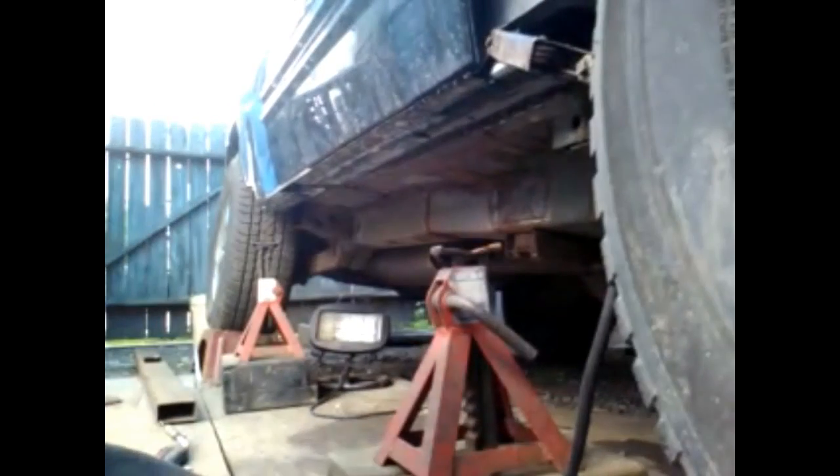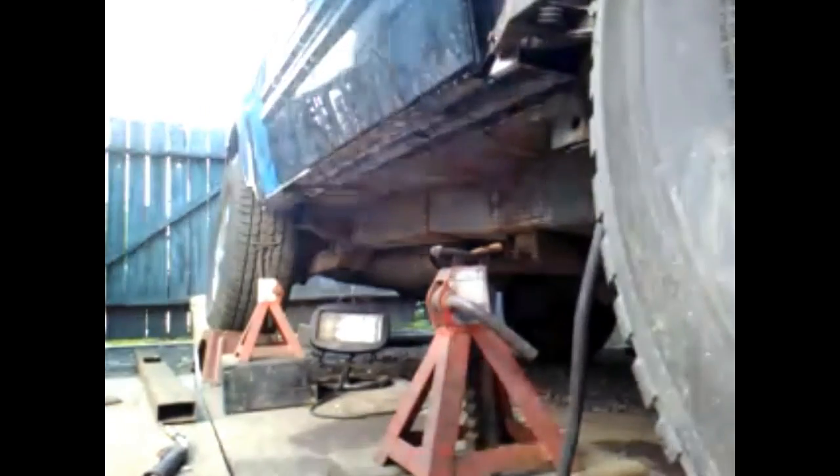Yeah, looks terrible. Half the problem is I'm using .035 wire, which is a pain to weld this super thin body metal, because it just blows holes through it like shooting it with a gun. Awesome. But whatever, it's only there as filler, not really for strength anyway. I'm going to have to go out and get some .023. Yeah, alright, let's get this set up and maybe start this thing in.